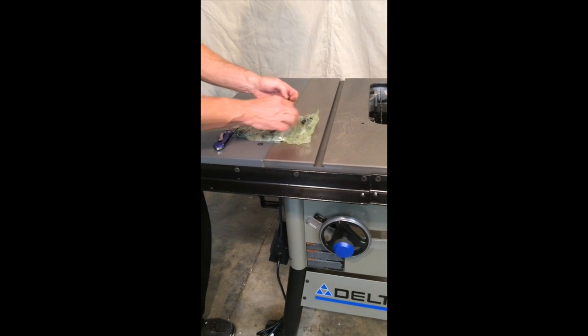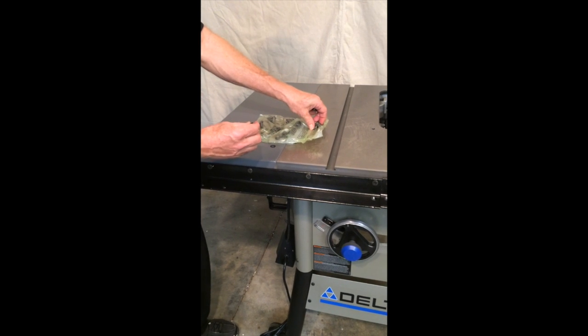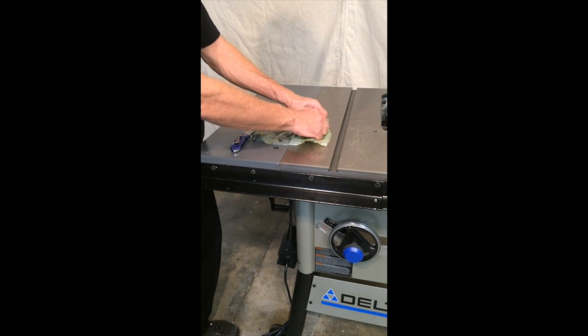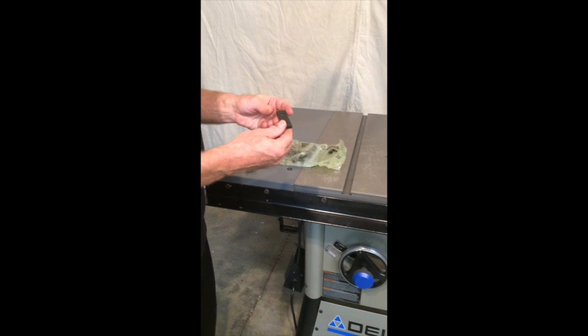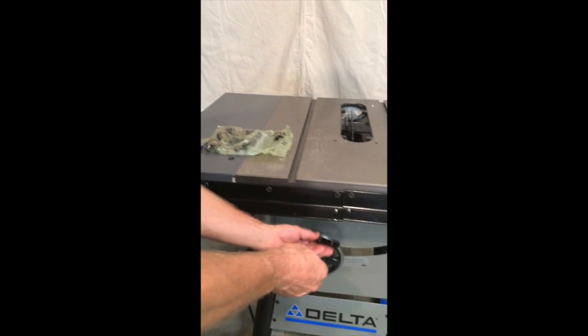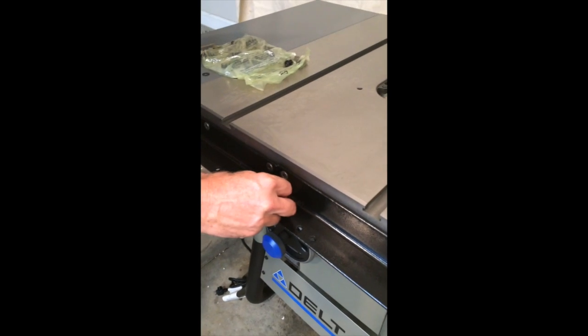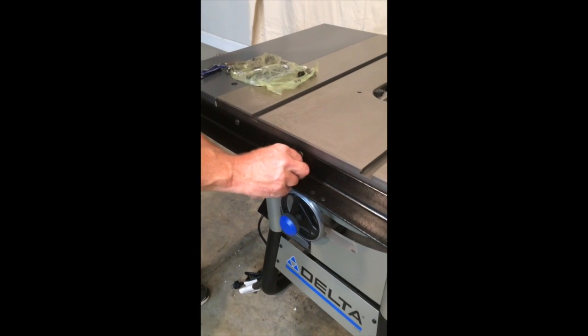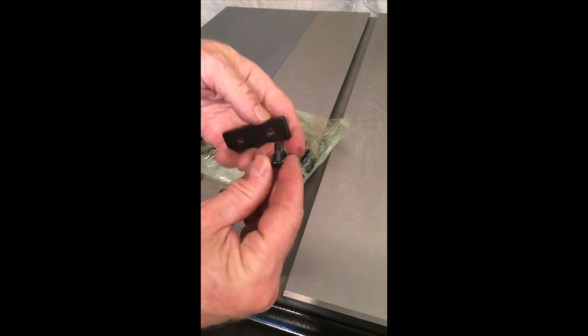Now, once you get both sides on, you want to put the connector between the two rail halves. There's a funny bolt this uses. It's got a big shoulder on it. I'm trying to show it here in the video. It's a little bit hard to find, but look in the packaging, you'll see it. The plate goes underneath, bolts through the top. Tighten that down completely tight.